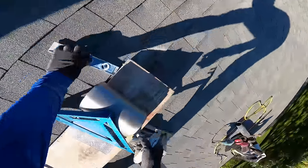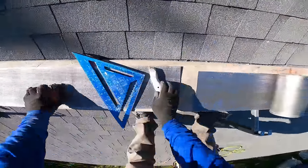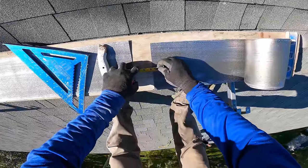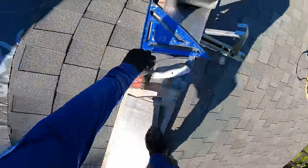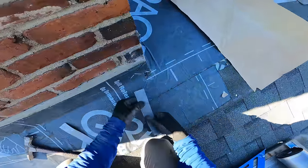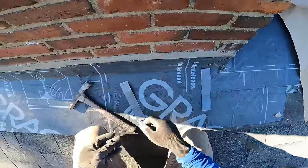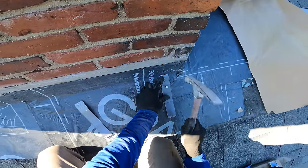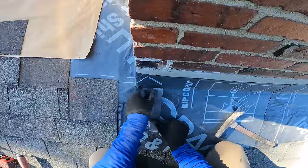I've got my big square and a decent blade — just scribe it the first time and the second time, and if you haven't got through then that's it. That's the first piece, and I'm going to mark the five-inch overhang on each side. I'll cut two small pieces at an inch and a half. These pieces are going to go here — I'll flip it over upside down, place it from about here, and just put one nail on it like this. Same thing on the other side. That's going to hold our front apron piece.